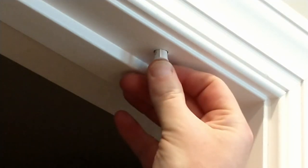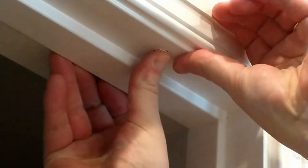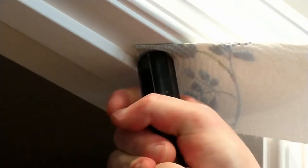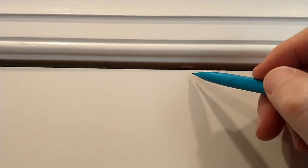These things are just friction fit, so really all you do is push it into place and it will just wedge in there. You could tap it with a hammer, but I just like to push on it with something because I don't want to tear it up. There's our sensor. If we shut the door you can see it right in there. We'll put a little pencil mark right here so that we know we'll line right up with it with our magnet placement.